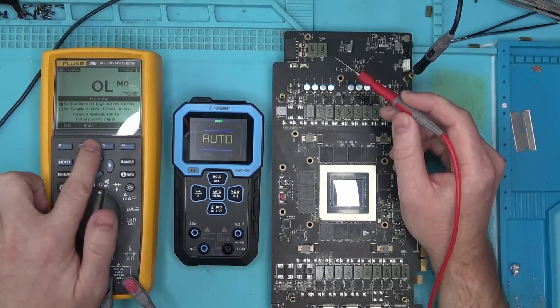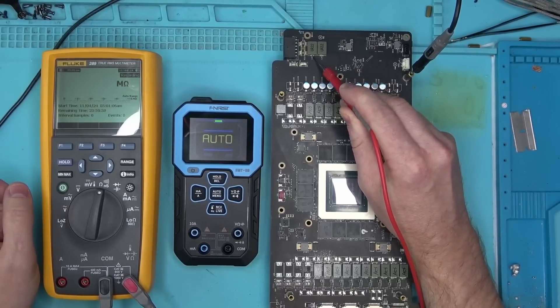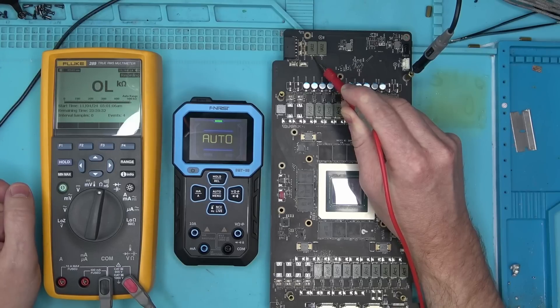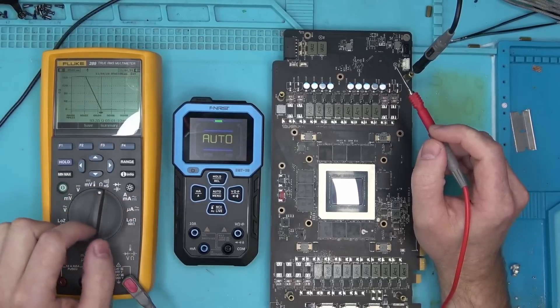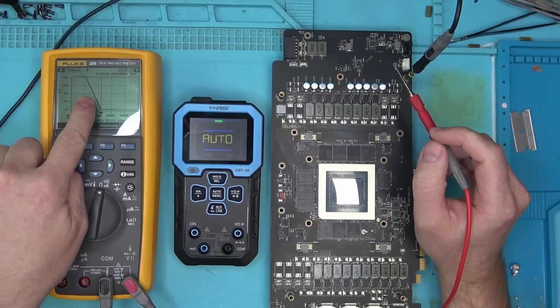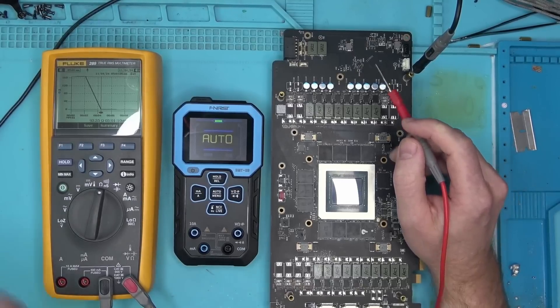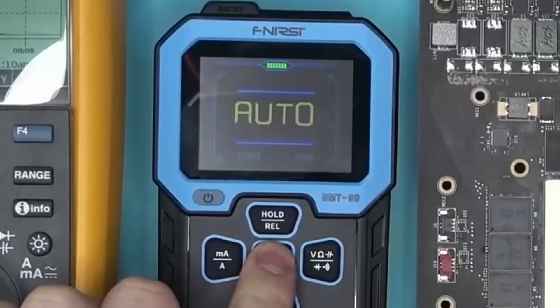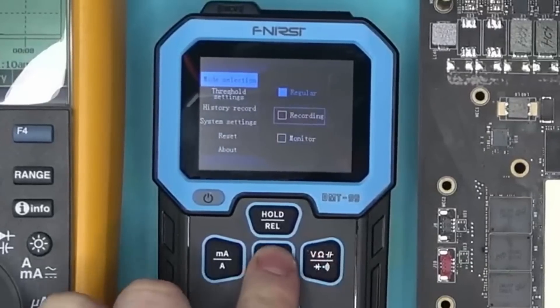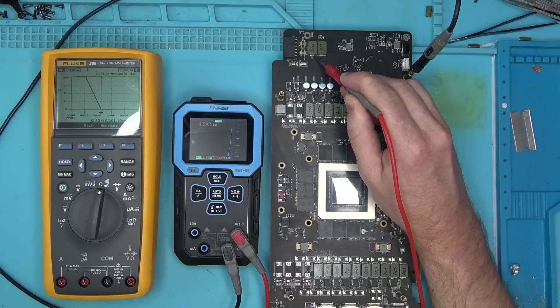I want to utilize the trend function — perhaps the only function which compelled me to buy Fluke in the first place. The only problem I'm facing with Fluke is that it does not provide real-time trend data, which can be used to identify odd charging and discharging behavior specifically on 12-volt rails. What Fluke can do instead is record the measurement, after which you hit stop, and then analyze how resistance has changed over time. This meter, on the other hand, can do it in real-time — I see both resistance values as numbers and a trend chart at the same time.